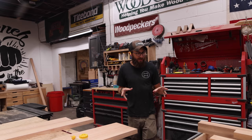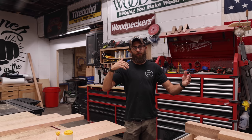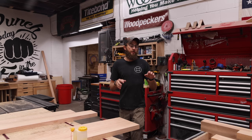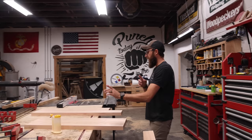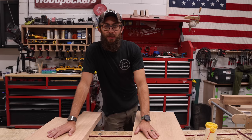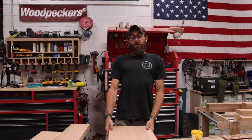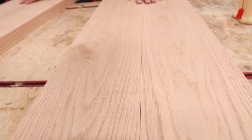We've got everything pretty well milled to size — some pieces are still long. I always like to leave things long going through the planer and jointer because there's a chance of snipe, which leaves a thinner spot on the end, so give yourself room to cut that off. This project is pretty simple but the devil's in the details — really take your time to make sure your boards are nice, flat, square, and jointed because of the way this design is. For the four pieces of the top I left them a hair thicker so I can run them through the planer once they're glued into their two separate pieces. I spent time flipping around material to make it look as good as possible — ideally I wish it was all quarter sawn.